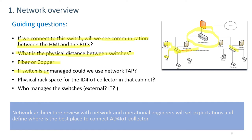If the switch is unmanaged, is there a place where we can install a tap to see the majority of the traffic? Or is it possible to replace the switch with a managed switch? Another question is whether there is physical rack space for an industrial Defender for IoT collector, which is typically a 1U server that would fit in a server cabinet. Finally, who manages the switches — is it an external entity like a vendor or OEM, or is it the IT or OT engineer?